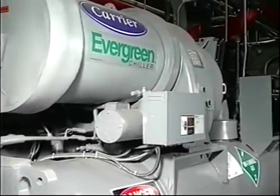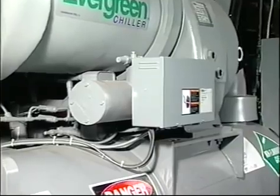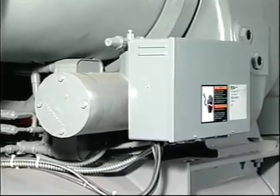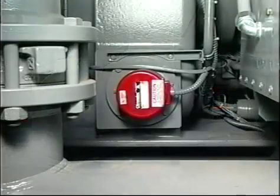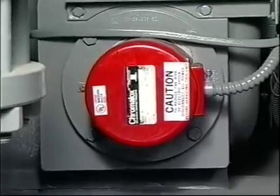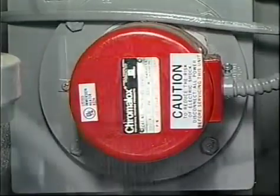The compressor contains an external oil pump driven by its own electric motor. It is mounted in the transmission oil sump and circulates oil to the main bearings and transmission gears. The crankcase contains an electric heater to keep the oil warm when the compressor is not running, to prevent the oil from absorbing refrigerant, which would dilute it. An external oil cooler is provided to cool the oil when the compressor is running.